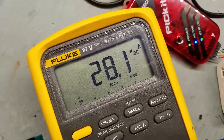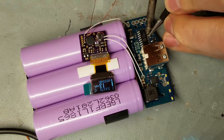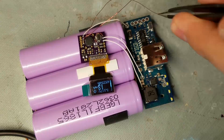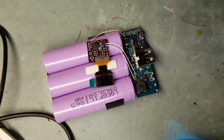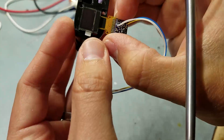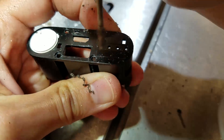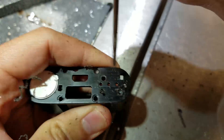After some tweaks I got the board running well. It consumed about 8 milliamps active and less than 30 microamps in sleep mode, which I think is actually lower power consumption than the stock four-LED battery indication. Once everything was working, I wired it into the MiBank with lines to monitor the existing current sense resistor and some pins on the existing microcontroller that indicate when the 5-volt output is on and when it's charging.